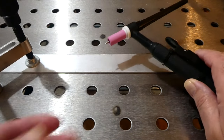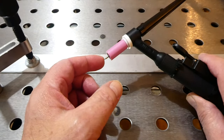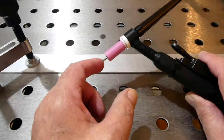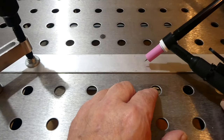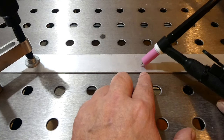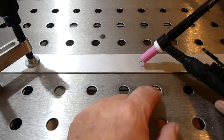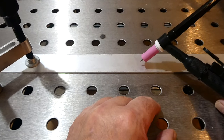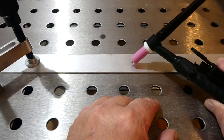This is the torch, and this is the tungsten rod — the T for tungsten in TIG. Inside the torch handle there's a copper cable connected to the tungsten rod, and there's a hose carrying argon gas that flows into this cup. When I'm welding, I'm drawing an arc, creating a molten aluminum puddle and moving it along, adding filler rod periodically. The gas coming out creates a cloud around the weld, displacing oxygen so I'm not oxidizing the weld — otherwise it would be contaminated.